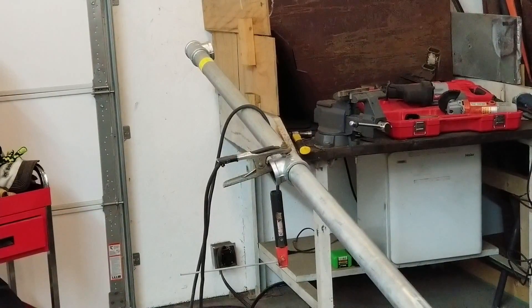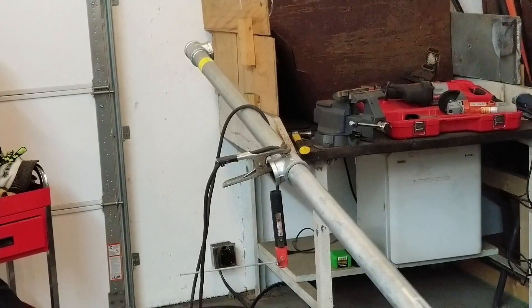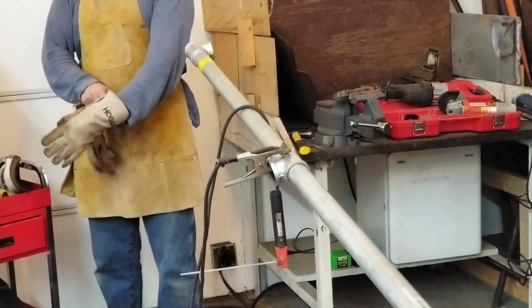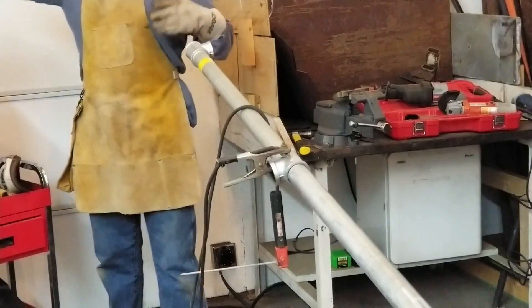Okay, I decided — I Googled it and welding galvanized pipe is not a big deal; it's basically the exact same, the galvanizing just burns off into some white powder. Of course you don't want to breathe it. You saw me jump on it and it held 240 pounds, but I'll feel a lot better with a nice heavy weld on there to really connect them in case those threads are a little bit weak. I may not even be able to walk back to the house after all this up and down because my back is getting tight already, but I'm making some good progress.